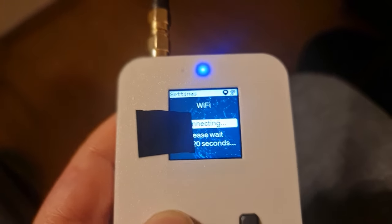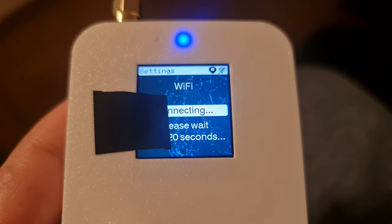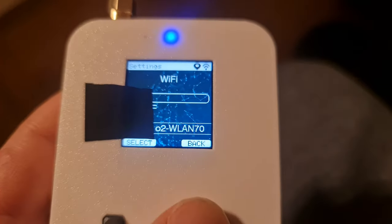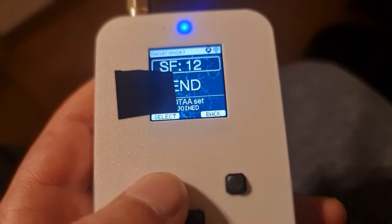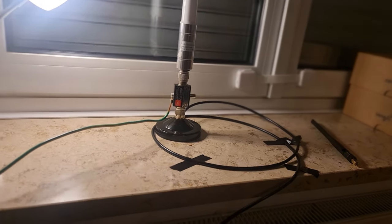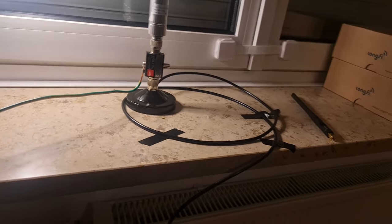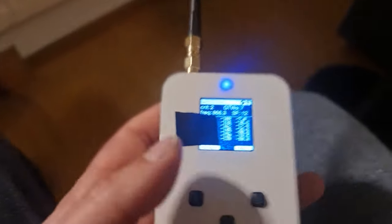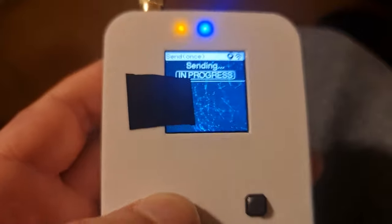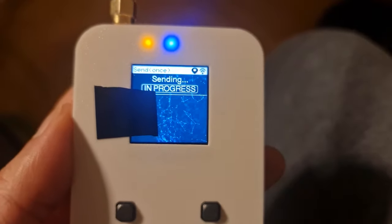Always disconnect and reconnect to your Wi-Fi. Preferably, when you want to test, stay as far away as possible from your miner and antenna because your body will interfere. In this situation it's not 100% perfect because I'm close and filming, but in reality you should be two to three meters away. This magnetic base is very helpful — it's three meters away and you start testing. This is explained in detail in part one.